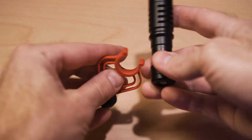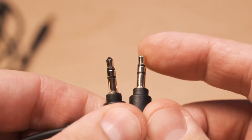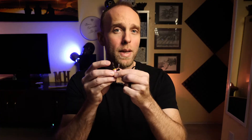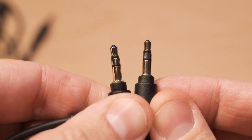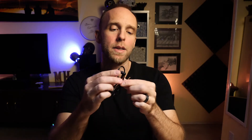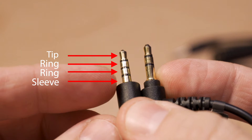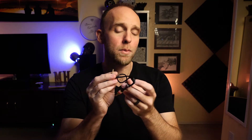So with our supplies, here's a very quick option for setup. Take the mic and put it into the included clip. Now there are two cables that come with the mic. There's one that looks identical on both ends — it's usually the coiled cable. The one you need has a tip, ring, and sleeve connector on both ends separated by two black bands. The other cable has an additional black band, creating what we call a tip ring ring sleeve on one end and just a tip ring sleeve on the other. It's usually the cable that's not coiled — that's not the one you need to use for this, so put it aside.